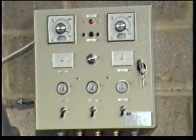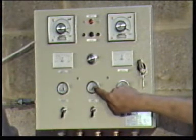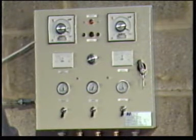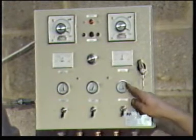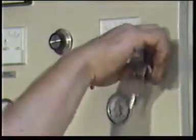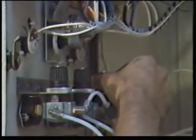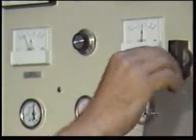The pressure gauges on the panel indicate the pressure setting for each airbag: the cylinder airbag, the inside flat airbag, and the outside flat airbag. The air valve on-off switches control the cylinder airbag, inside flat airbag, and the outside flat airbag. Inside the control panel, air pressure adjustment is carried out by turning the knobs clockwise to increase or anti-clockwise to decrease the pressure. The normal pressure settings are 30 psi for the cylinder airbag and 28 psi for the inside and outside flat airbags.